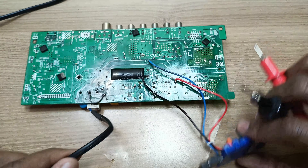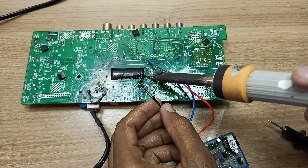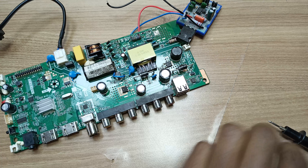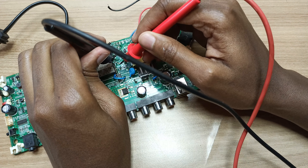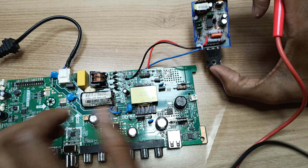Unfortunately the TV blew a fuse, and this time around I have the TV itself, not just the motherboard. It blew my fuse wire as well as the fuse on the plug. I have already replaced this fuse, but I have not yet plugged in the TV again because I know it will just blow this fuse again. So for that, let me use my dummy load.